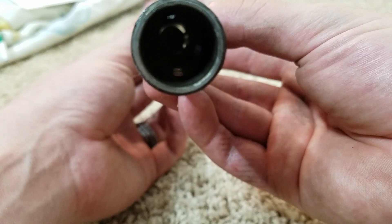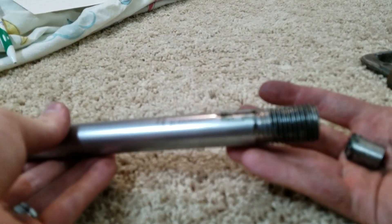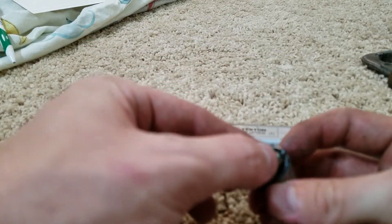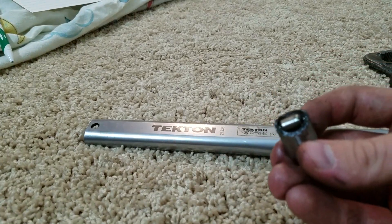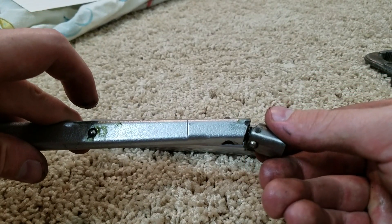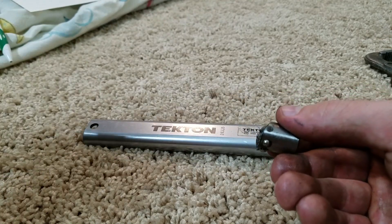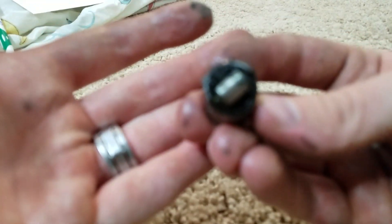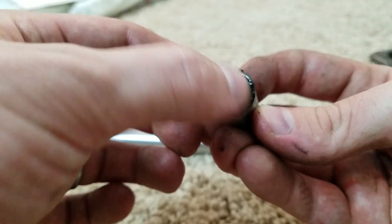We still have one more thing in there — there we go. Just by the fact that it didn't fall out, I have a feeling this grease is bad, a little on the thick side. This is your little clicking mechanism right here. The other side is the part that actually contacts it — they have pressure on each other, and when it finally gives to a certain foot-pounds of pressure it'll go 'floop' against each other. That's what makes the clicking, and it's usually the grease in here that makes this not want to move.